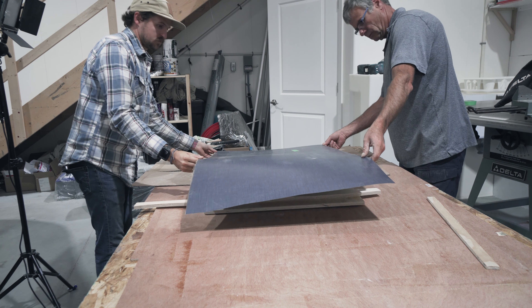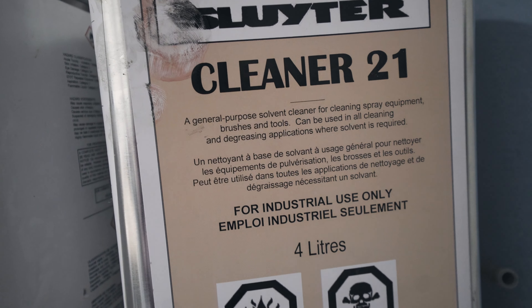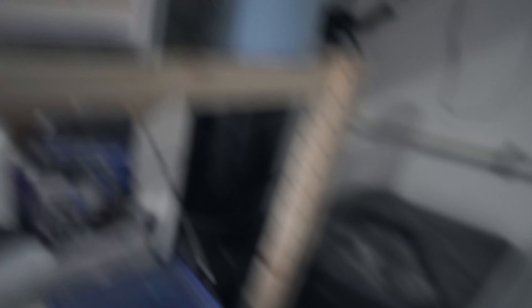It was like a $60 sprayer and it's still working, still going. If it broke tomorrow I'd go buy another one in a second. All you have to make sure is that you clean it really well when you're done with it. Once you've used it for glue I wouldn't really call it a paint sprayer anymore — it should just be strictly used for spray glue and spray adhesives and I would never use it for paint again. Before you start spraying, every time you go to spray, it's a good idea to run some cleaner through the gun. Fill up the canister with a little bit of the cleaner and just run that through. If by chance you didn't get it perfectly clean the last time, the cleaner usually can soften up the glue so you don't have to take the whole gun apart — but sometimes you do have to rip it apart again.